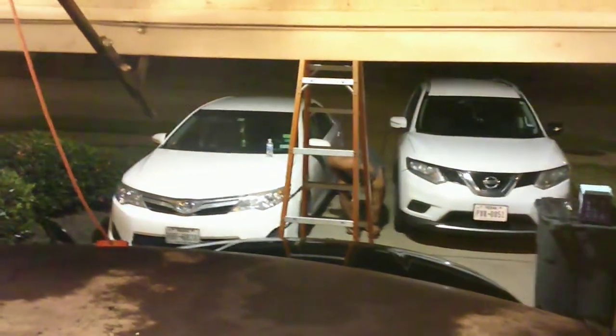We're going to feed into that — we're going to take the plug down in the garage, feed the wires through, and make them together. I didn't record the wiring because the lights went out since we had to shut off power to the garage, but basically the black goes together, the whites go together, and the bare coppers — which are the grounds — go together. Now we've got light outside.